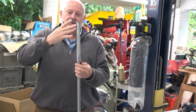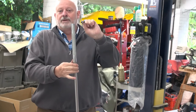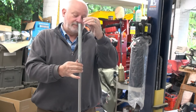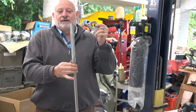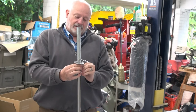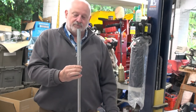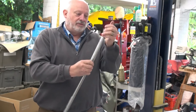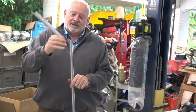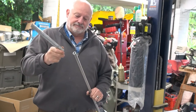I'm going to paint this black and it'll be a weatherized cap, because it's going to hang down well below the ball bearing. I've also got a plate — a plug — that I'm going to weld along the top here. Once I fully weld that in to seal it so no water can get in, theoretically. I've also got a bigger washer that I'm going to weld down here as a collar. And I've got this other piece of stainless steel that I'm going to clamp down onto this shaft — once clamped, it will keep the two pieces together so in transport the ball bearings won't get lost, and it will also prevent it from blowing off.